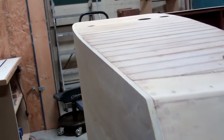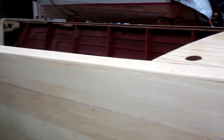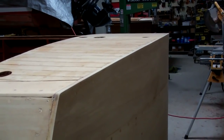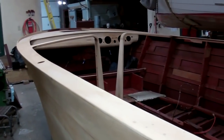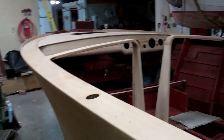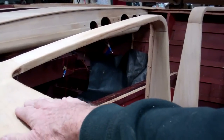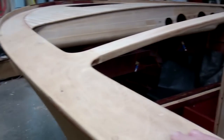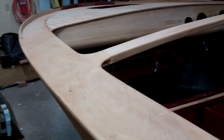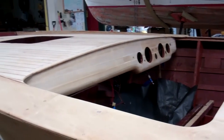We'll put a moisture meter on the wood this morning. I know it's not dry enough to stain yet — we will give it at least 24 hours to make sure that it is. Once we achieve that reading, we will go over the entire boat by hand, very lightly with 120 grit. Because one of the things that the bleach does is raise the grain a bit, which is actually good for purposes of staining. But as I rub my hand across the surface, it feels like the boat has a five-day shadow and needs to shave. The bleaching came out just beautifully.